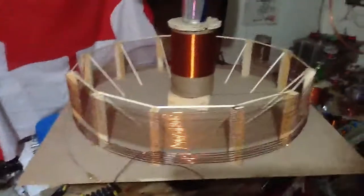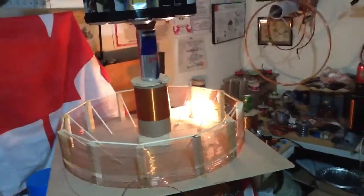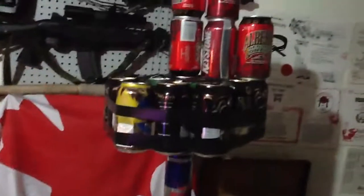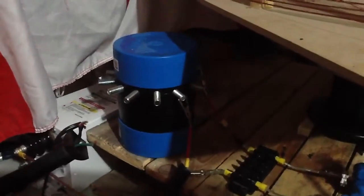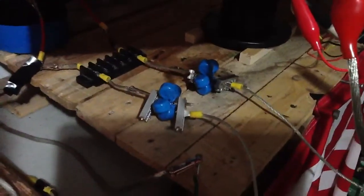I can run through the specs of the coil. This is great stuff I'm seeing here. I don't want to get too close with this thing or it starts to spark the camera, and I just don't want to lose that bulb — it's been a pretty good test bulb, really long filament, and it's a 60-watt bulb. So we've got 25 cans, and that ends up being about 31 picofarads. We've got a new adjustable spark gap, and with 5 nanos on each leg that gives about 2.5 nanos, tuned for about 500 kilohertz.